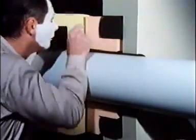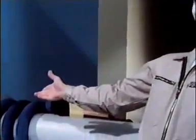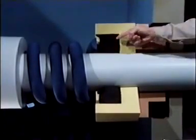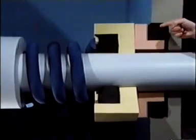Wear cannot be totally excluded, but it can be compensated with a spring, for example, which presses the seal face to the stationary seat. Here we have it — the mechanical seal with its five components: rotating seal face with secondary seal and spring, and stationary seat with secondary seal.